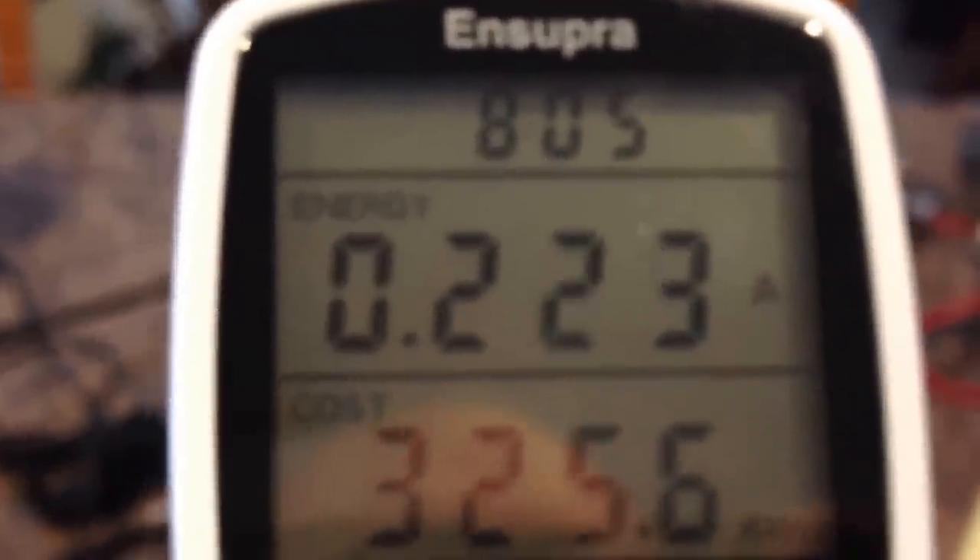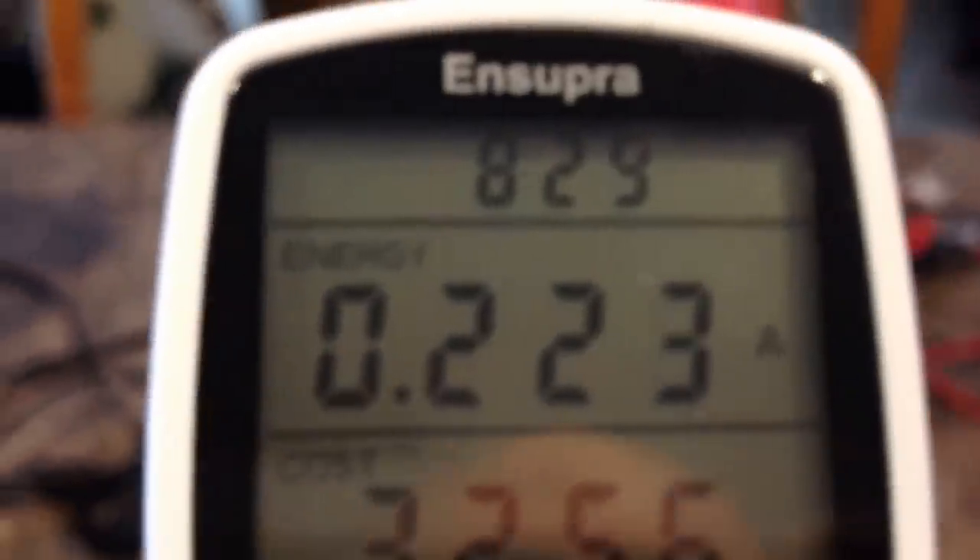I'll try to explain this a bit better. I've got the laptop plugged into the modified. By the way, most laptops will run off a modified inverter — about 80% of your appliances will. Right now, I've got the kilowatt hour meter plugged in. We're using 0.23 amps, but that is at 120 volts coming out of the modified inverter. Since we're drawing out of a 12-volt battery, you need to take that times 10 — so it's really drawing 2.2 amps out of this 12-volt DC battery.